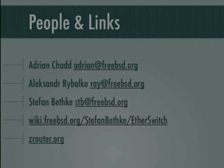Which is one of the reasons we split the MDIO bus from the Ethernet controller. So if I wanted to support some of our real legacy boards with these specific firmware files, then we have to bring up MDIO 01 first, squeeze a bunch of firmware over it, and then manually reprogram the MDIO bus. Yeah, and I had to hack the bootloader to do that. It's done and over, but my interest still remains.